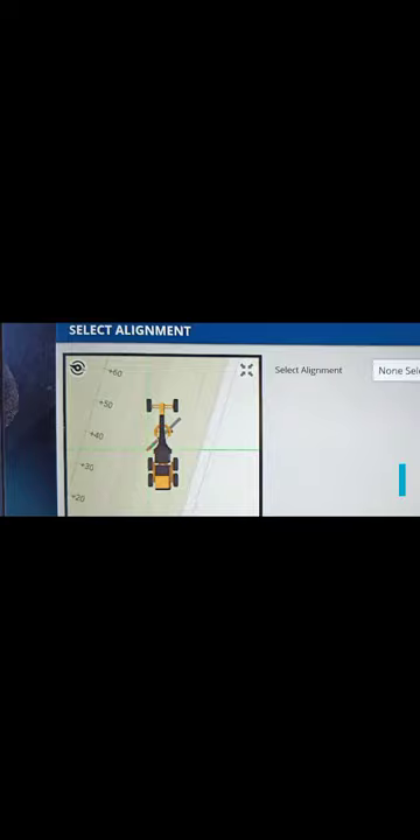The next line would be the edge of footer. The next line would be top of slope. Then toe slope. Let me re-explain that — the wall would be in those first three lines, and then a few-foot flat spot to a hinge point, then top of slope, then it slopes down to toe slope, which would be those green lines. It looks like a three-foot flat bottom, then toe slope again. The pink line would be top of slope and the red line would be edge of AB for the road.